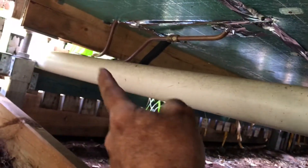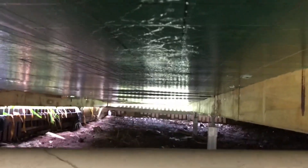this little gap ruins the job. Over against the edges it's very hard to seal up against the timber unless you silicon it. Any gaps at all are going to ruin the outcomes for the customer. If you look up in there, you can see how far up it goes — it goes all the way through. So it's totally useless the way this product has been installed.